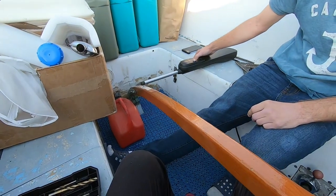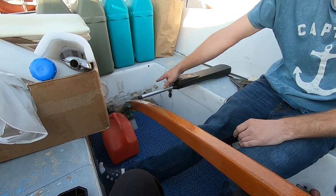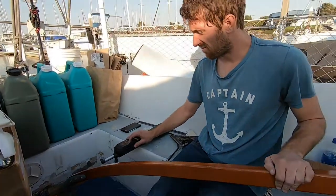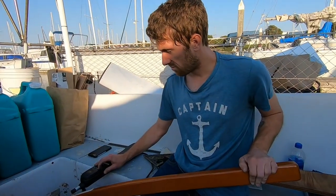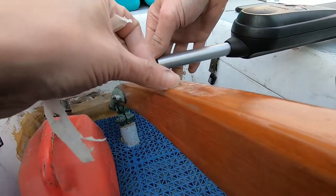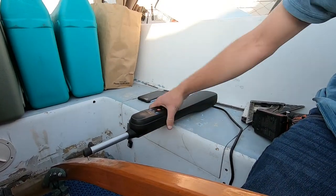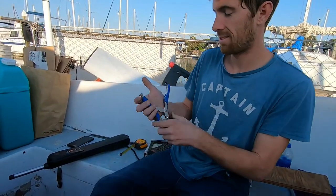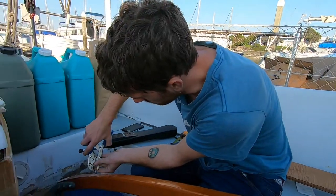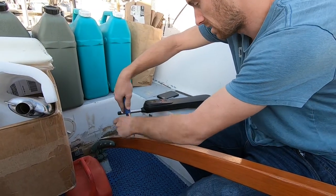It's a little wobbly — it's because our tiller is kind of wobbly, so I have to tighten up the nut. Cool, perfect, it works! We just have to go out and test it. It could probably go down a quarter inch because I can see it's going up a little bit, which is gonna make it slip off. We finally have a freaking autopilot! It's gonna be so nice. Took us all afternoon, but this is a lot of figuring, calculation, and measurements — double checking everything.